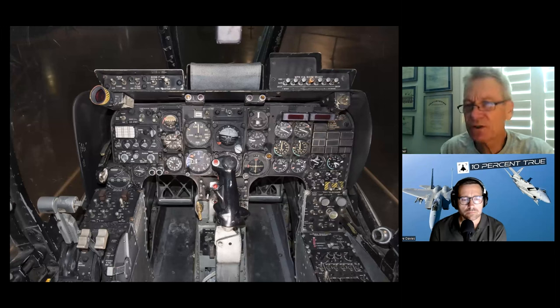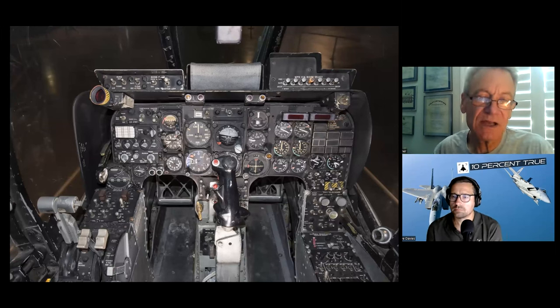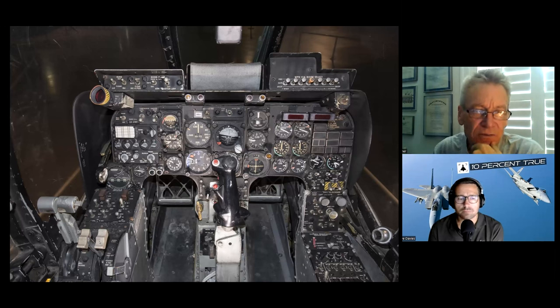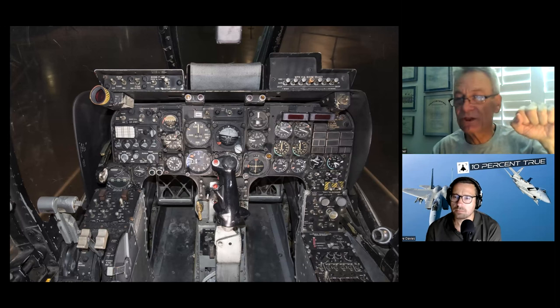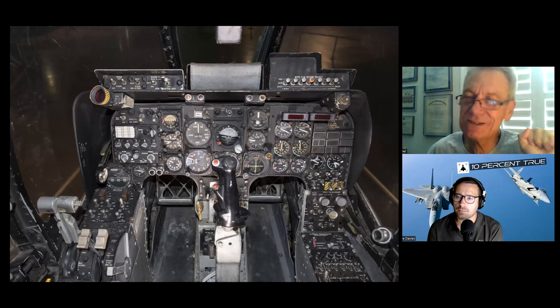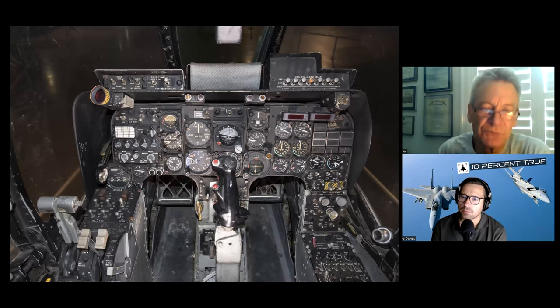This lever, if pushed forward, is a friction lock — you could adjust the tightness for the two throttles. For a turboprop airplane, these are the condition levers. Condition levers control fuel on/off and how the propeller operates in response to the throttles. For takeoff or landing, these levers were all the way forward, and the prop would spin at maximum RPM all the time. When you move the throttles, you change the amount of fuel going to the engine, and to keep the RPM the same it changes blade pitch — giving instantaneous thrust response with no RPM lag.